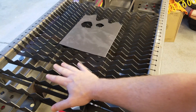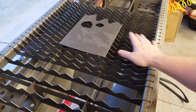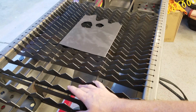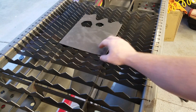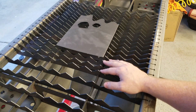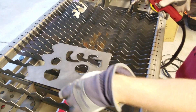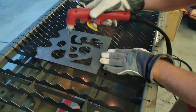Our Surflat Plasma Table is put together — we've installed our slats, everything is bolted together. We've got a ground clamp on our table, hopefully that transfers to the workpiece. We've got a galvanized steel bucket below to catch all the slag, sparks, and everything. The plasma cutter is turned on. All that's left now is to test it out — make sure it cuts and that the slag bed works the way we hope. I've got some 20–22 gauge mild steel sheet and we're just going to freehand cut some stuff. Definitely looks like it's working to me.